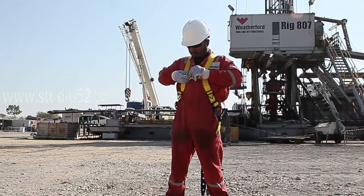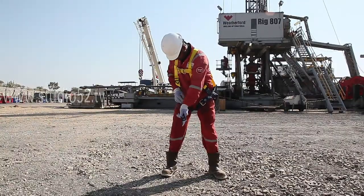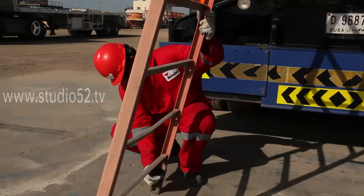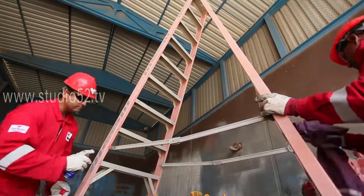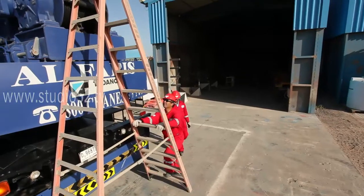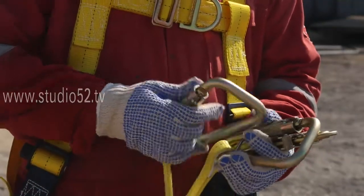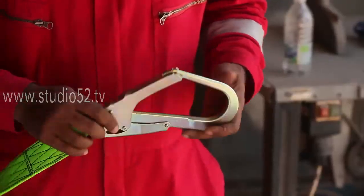When working at height, remember these safety considerations. Use correct lanyards, either restraint or fall arresters. If working no higher than six feet from the ground, use a ladder with assistance provided by other co-workers. Every time you use a ladder, you should do a pre-use check beforehand to make sure that it is safe for use. A pre-use check should be carried out by the user both at the beginning of the working day and after something has changed. Also remember to use only secured and approved anchor points and inspect the PPE being used.